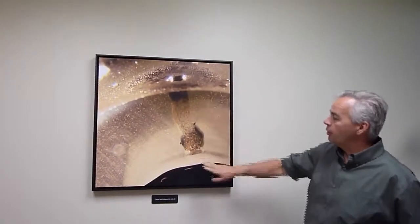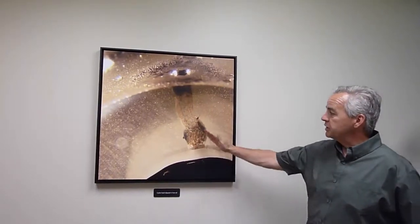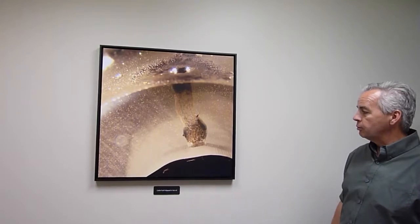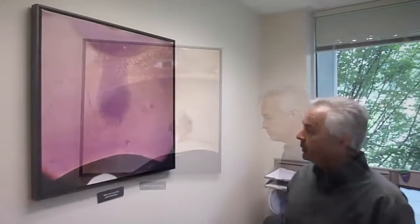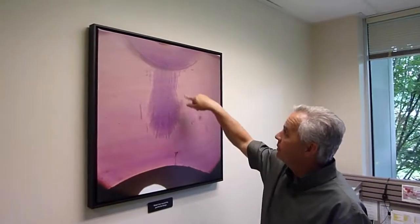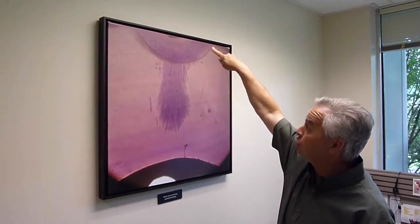Well, this is a failure hole. There's no particular defect to be observed in this one, but you can see how the failure looks a bit like a wormhole, going through the insulation. And so here we have a bunch of things happening in this one. We have our water tree again. This time it's growing from an imperfection that was created by a neutral corrosion problem that's kind of outside the picture here. But we have this huge water tree, and then we have this electrical tree.